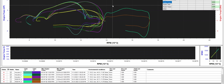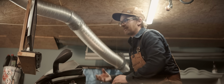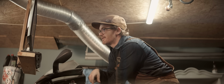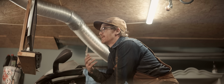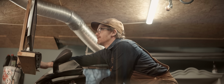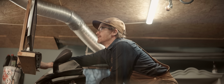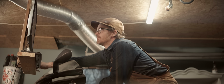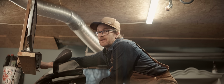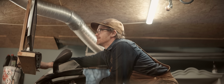We went from 6 to over 9 horsepower with the pipe extension. There's something weird going on because with all the port areas and stuff, this cylinder should be more than capable of having enough flow at high RPM like the pipe was originally intended to be used for. But hey, over 9 horsepower versus 6, so that's a win.